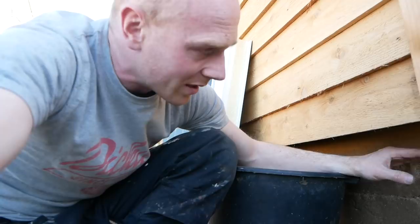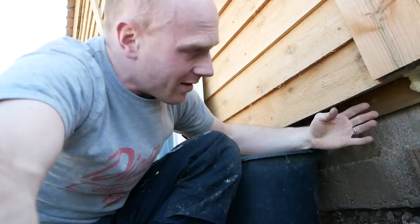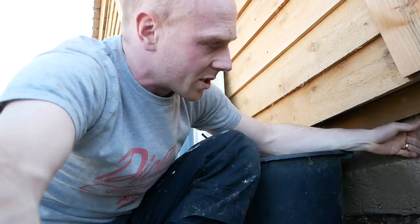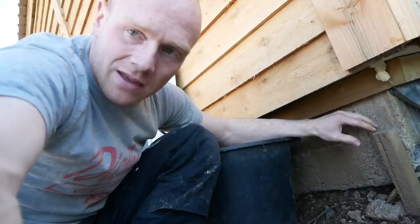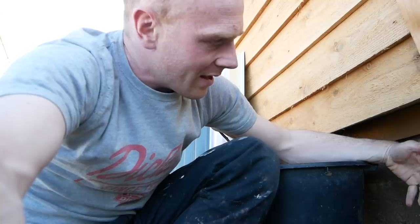Because all of our wall build-up is external outside of the frame, our frame finished pretty much level with the concrete. All of this is kind of overhang, which is fine - there's no problem with that. And of course, that sheds water away from our foundations and our concrete. I'm going to put some natural stone under here, so I'm going to be putting a liquid DPM on here where the original DPM is torn off. I'll be putting stonework against that, so the concrete is really well set back and there's no real chance of moisture getting up through that into the floor.